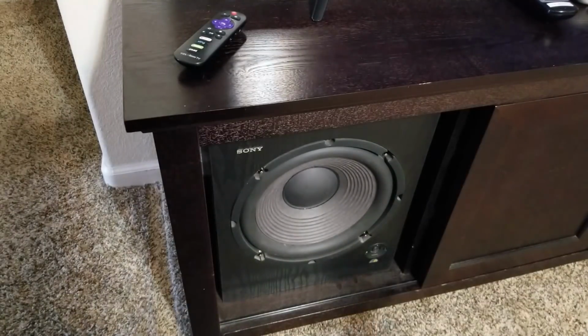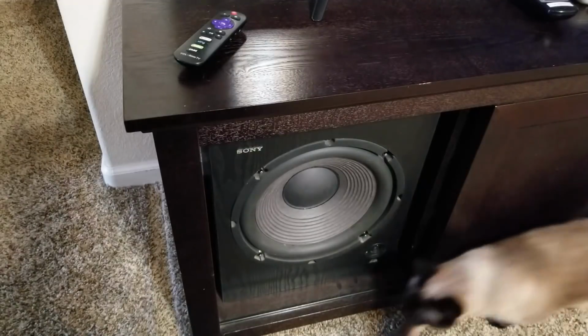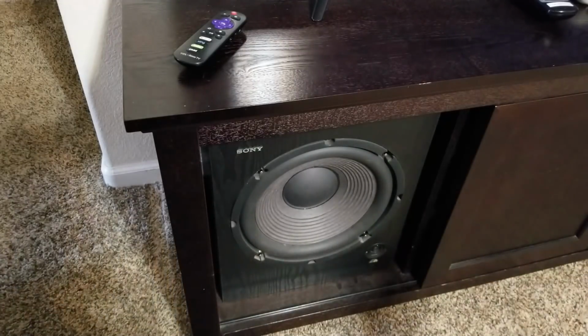And of course it's not doing it now, but when it does it, what happens is the bass level decreases dramatically, along with some crackling and some popping, and the cone actually looks like it develops a DC bias where it wants to be in or out slightly, with maybe a few volts of DC pushing the cone in or out as this happens. Anyhow, so I'm going to pull the thing apart and see what we find inside.